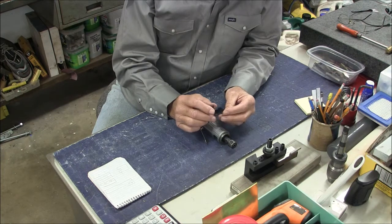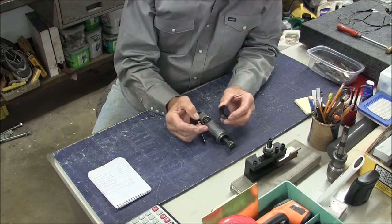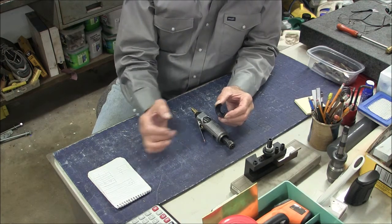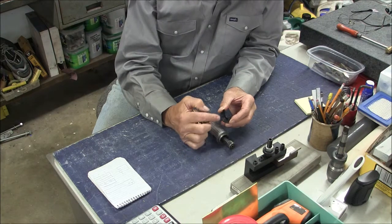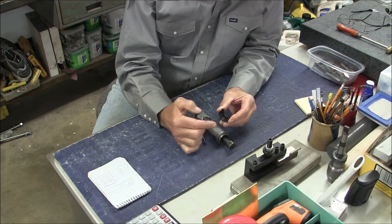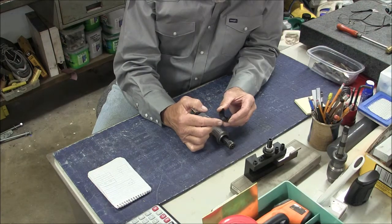So what I'd like to do is put a relief in here, then go up against the solid end stop on my carriage and feed out, because obviously I want to get as close as I can to this blind end. What I want to do is run my lathe in reverse and run the carriage up against the end stop and then feed out, but I don't have an insert bar that'll go in there.